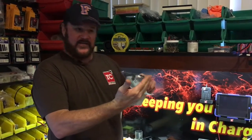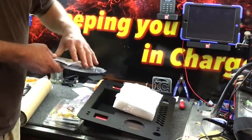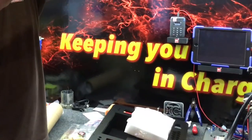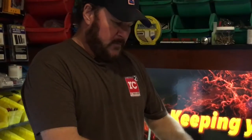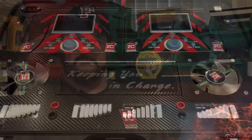The touch latch mounts to the front of the deck. When looking at your door, the face of the door has a beveled edge — the back side is cut so that when the door swings shut, the beveled edge drops into the case and does not jam as it's opening. So remember: the beveled edge goes front and down, and the hinge goes on the back. Hinge screws and everything will be inside the bag so you can install everything.